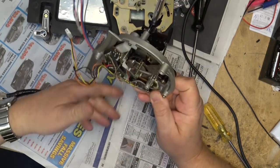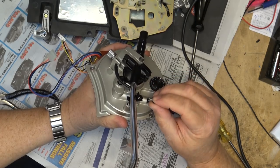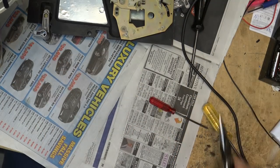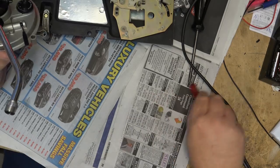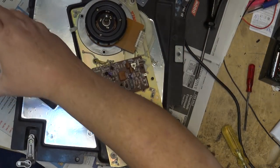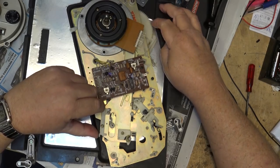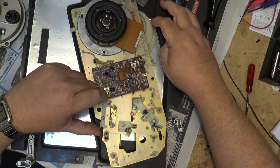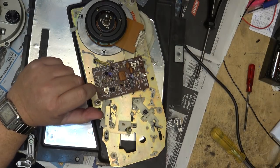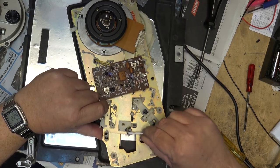I think it was just this lever here. The dampening arm was at fault. So now, as you can see, it'll lift up. Before I put the tone arm back on, I want to lubricate the rest of this mechanism, because some of the grease is going to be drying up on that too. Let's bring the chassis back a bit and set this over to the side. I think this one's probably okay. The grease here doesn't look to be dried up. We'll wipe it down. Yeah, this grease is okay.